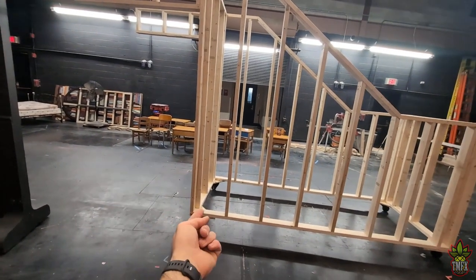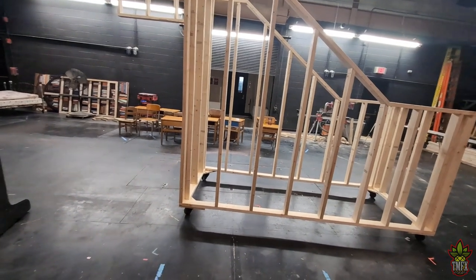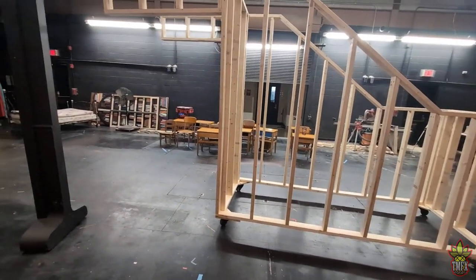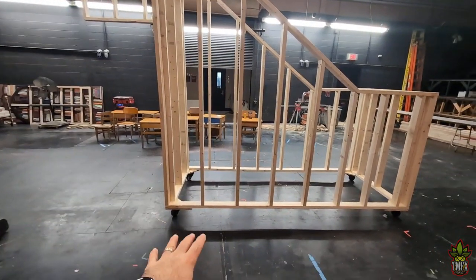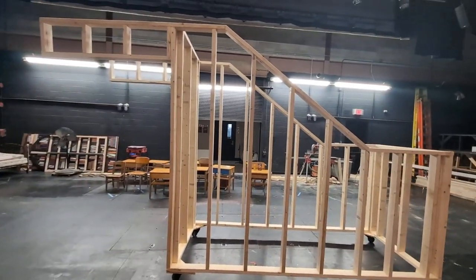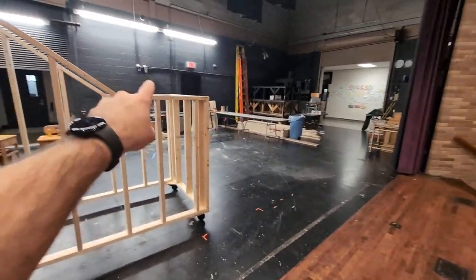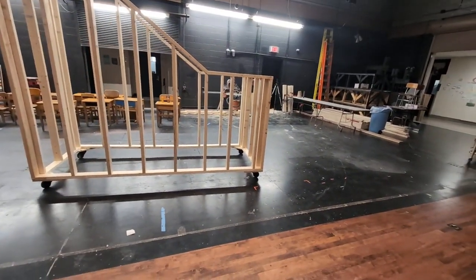Alternatively, you could tip it all over and just throw a quarter inch shim between the plywood wheel plates and the framing, or anywhere there underneath the wheels. And I would elect to leave that alone and just make those changes here. Those are easy to make now, but they're going to grow more difficult to make as we move forward. Today, this lower set of stairs has been constructed and saved, and it's in the basement.